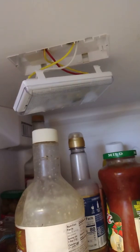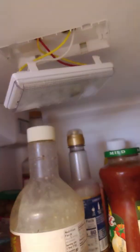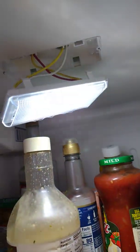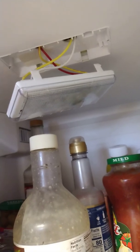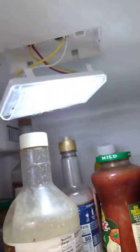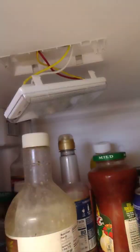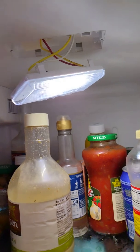With the two resistors in parallel — same issue, but it does flicker on and appears to be working better. It messed up once. Definitely working better though. I'm going to take this out one more time and look at the capacitors, but definitely that resistor was part of the problem. Now I can't get it to flicker at all, so I'm going to consider replacing the capacitors since we did get it to flicker once.